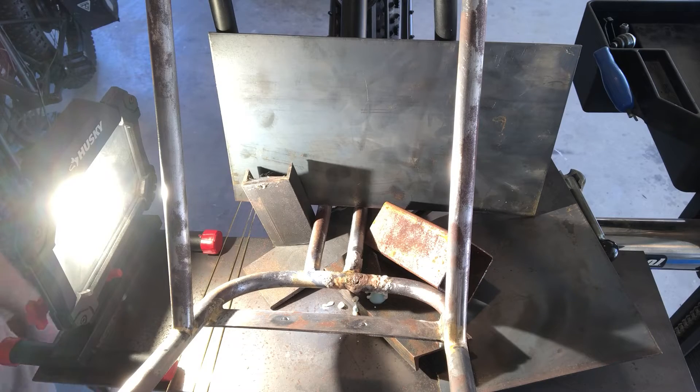I'm taking a break to see how I did — the camera and the light and everything was in my way. It went pretty much as planned: the flux got clear, but then when I went to add the bronze it wasn't wanting to adhere to the steel. So I added more heat and was trying to shove some rod in there, but this tubing is so thin that the thin edges along the crack were melting away. So now I have a hole there that I'm going to fill. I gave it a rest — one, because my iPhone can't handle very large files, and two, I didn't want to overdo it on the heat since this joint has already had too much heat put into it.